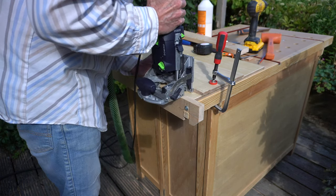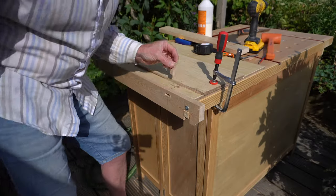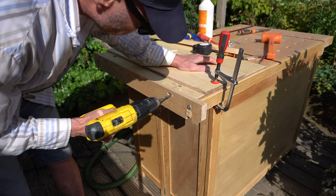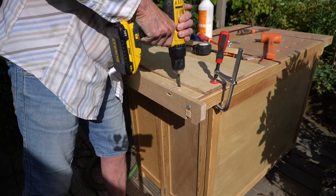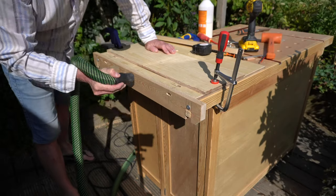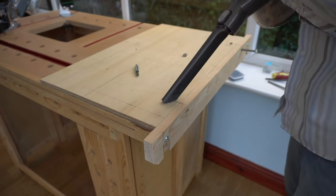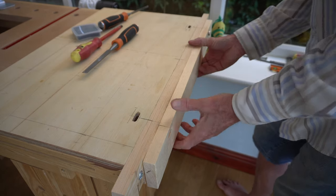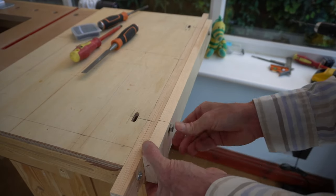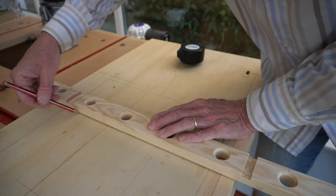The plan was that the domino holes would meet up between the top plungers and the side plungers. In reality the two plungers were just slightly short of each other, so I had to ream them out with a six millimeter drill bit. The last thing I needed to do before fitting the bolts was drill into the bench so my four inch bolts could be fully wound in. At this stage I was starting to realize the four inch bolts probably weren't quite long enough — I would have been better with six or maybe eight inch long bolts, and I would have also needed a longer drill bit.